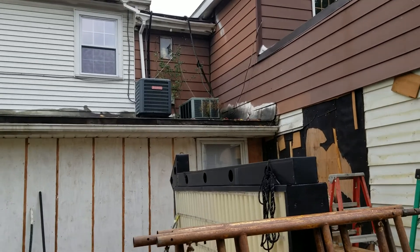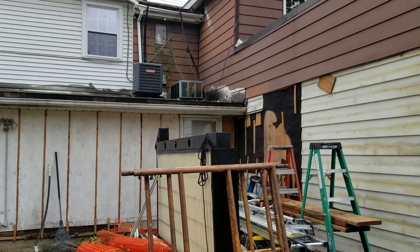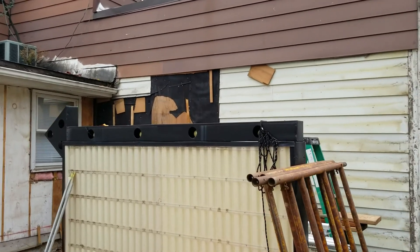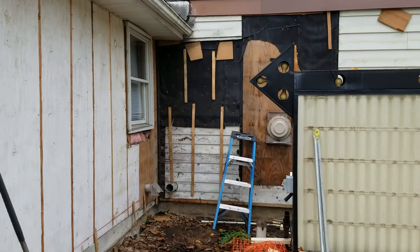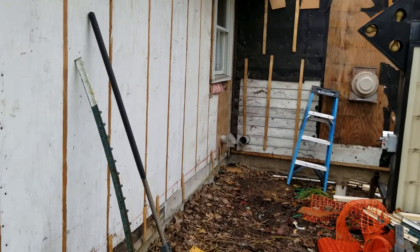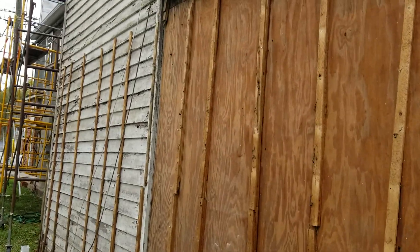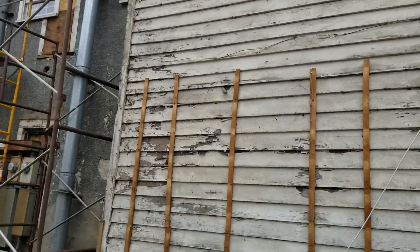That flat roof is slippery — it's not in good shape — so we got to get that cleaned off so the guys can work on it. We need to put a leveling board on here, and I'm gonna recommend a three-quarter inch as opposed to half inch. We need to know if this heating vent is operable, and we'll find out about these two dryer vents or bathroom vents. We're definitely gonna need to run some leveling board here, and the three-quarter is probably most suitable.